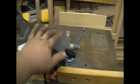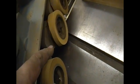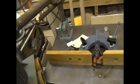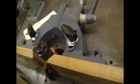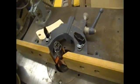I still need to make a dust shroud. I'm going to strip the table down — take the fence off, take the power feed off, and take the orbital sander to the entire surface and polish it up. The power feed looks like this cabinetmaker had a little mishap before — you can see it went around. Mounted on this side, if you don't have the power feed tight, it will move into the cutter. If you have it mounted over on the other side, the power feed will move away from the cutter. Anyway, it is up and operational.